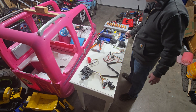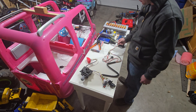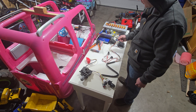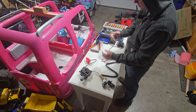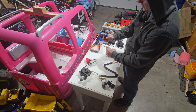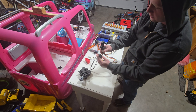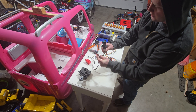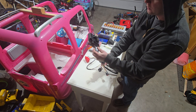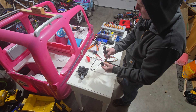What we're gonna do is use a wire harness I found on Amazon that's meant for kids cars, and I'm gonna scavenge what I can from it. I'm gonna cut these motor connectors off, cut the charging and power connection off, and then I'm gonna hope that the high-speed low-speed switch and forward-reverse switch will plug right into a stock Power Wheels gear selector so I can use that for forward-reverse and high-low.